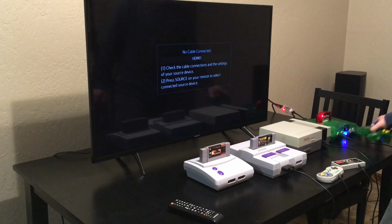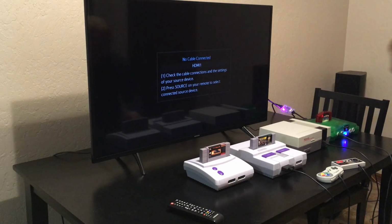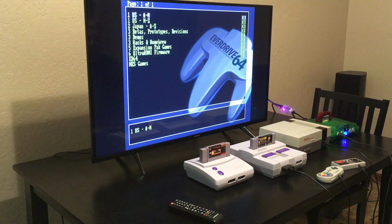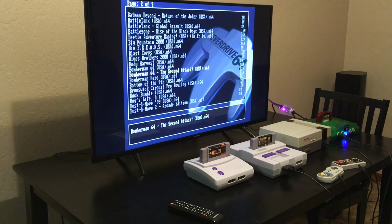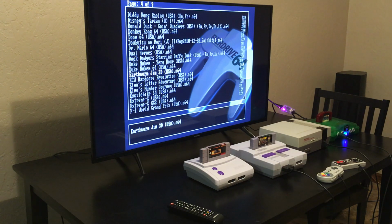I have another Nintendo 64 that has RetroFix's RGB mod, but I didn't want to pull it out of storage, and I figured that one's probably pretty likely to work. One of the reasons I want to make this video is so that you guys know what setups will work for sure. So right now, this is the Nintendo 64 RGB board by Tim Worthington with Bordy's firmware on it. I can see that the RAD2X is turned a pink color, so that means it's in RGB mode. I'm going to fire up Diddy Kong Racing, because that's one I'm pretty familiar with.